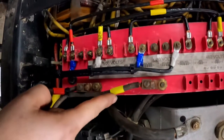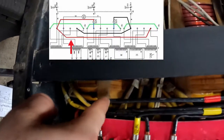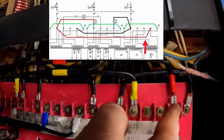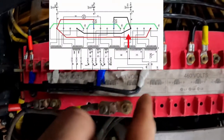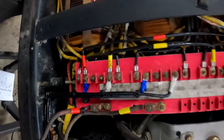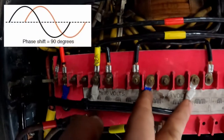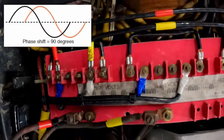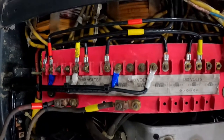So you've got your input phases right here — yellow for one phase, red for the other. That on the front is connected to that on the back. You'll see this jumper follows up and over, feeding this transformer 180 degrees out of phase with this transformer. The yellow comes in and is connected directly there, jumpered down to feed that 180 degrees out of phase. The middle phase is powered by the capacitors. You'll see there's a white pair and a blue pair of capacitor wires. The order is irrelevant because you can only be 90 degrees from either phase — 90 degrees left or right. We'll graph the difference between single-phase and three-phase and what I mean by 90 and 180 degrees.